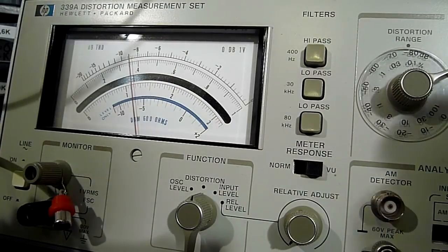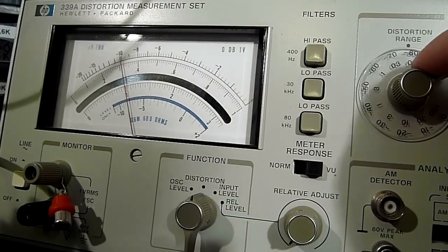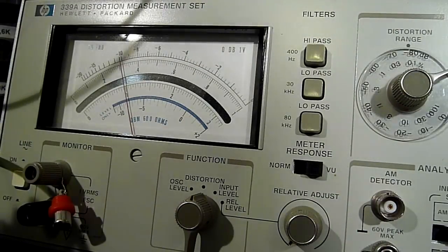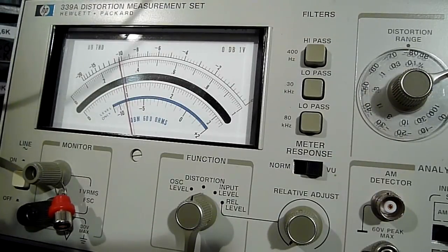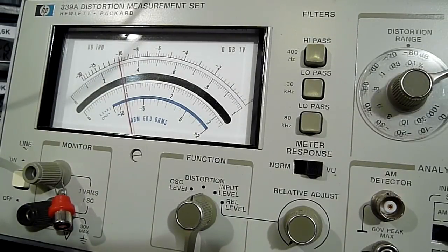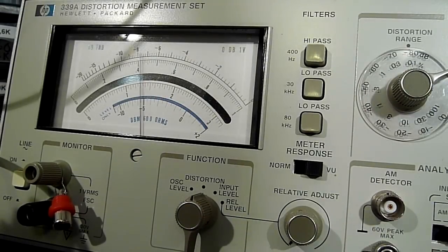and look at that. The distortion scale is 0.01% full scale, so we are pushing 200 watts on one channel, though, but 200 watts at 0.003% THD plus N. That is considerably better than before. I think I have found the problem with this amplifier now. That's quite obvious. Let's see how high we can go before we run into issues.